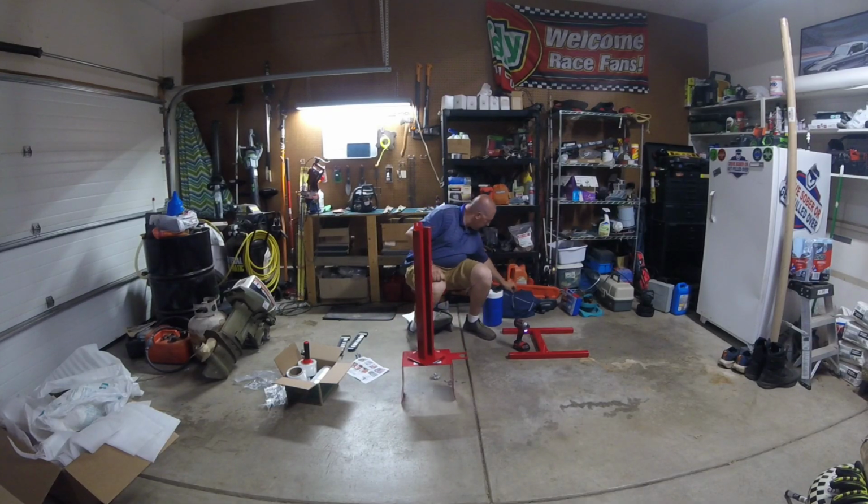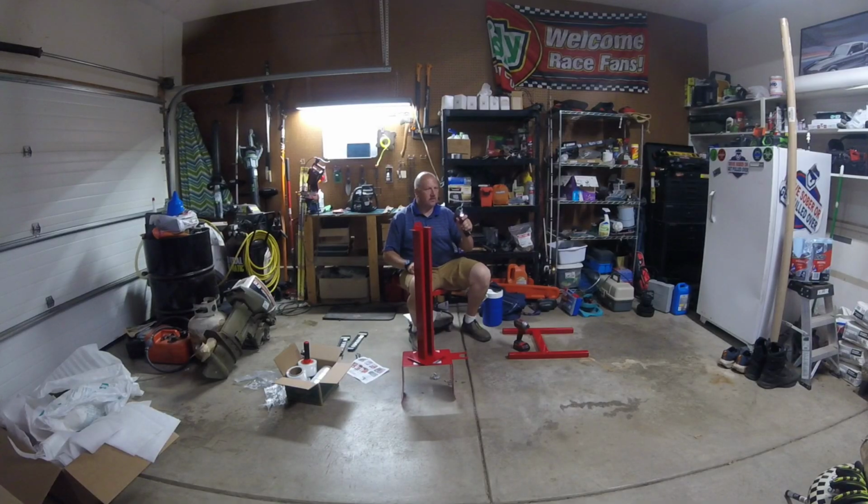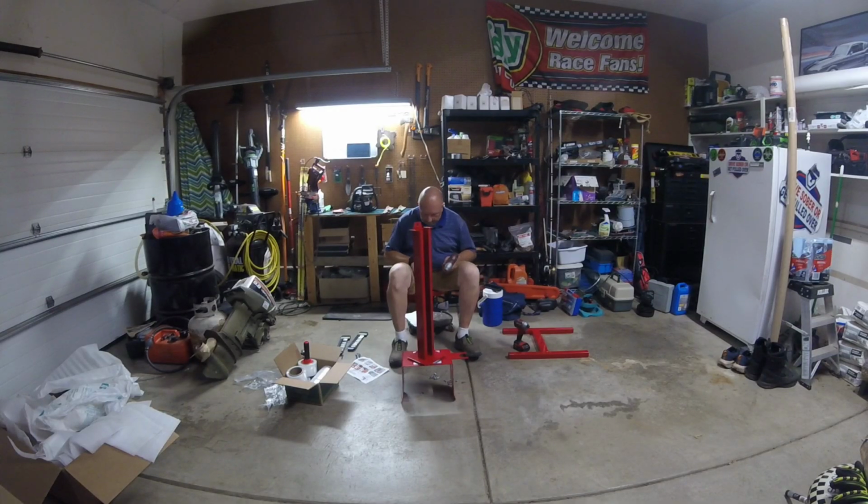So this is my go bag for my chainsaws. I keep extended earmuffs, safety glasses, all my files. I keep my Milwaukee M12 with a 3/8 bit and a 1/2" drive socket, and that's what I use to change out and reinstall all my bar nuts when I'm out in the field. If I'm sawing and need to swap out a chain or do some maintenance, I just use my little M12, pop the nuts loose, pull the bar off, and the brake handle cover and stuff, swap chains, put it back on, and go.